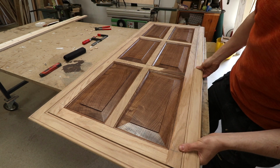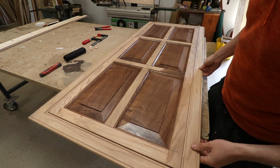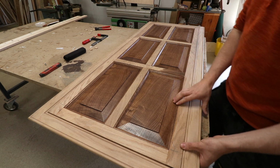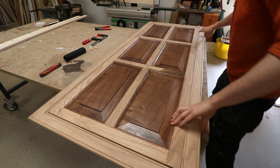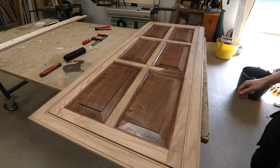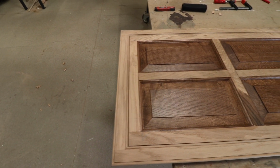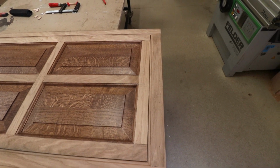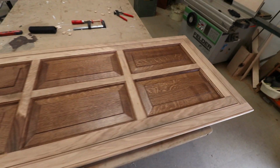The height's perfect at that setting. I couldn't have got it better if I'd tried. With a bit of luck. Quite often you'll be 0.5 mm out, so cut it again. That looks bob on. We've got about 1.5 mm at the top and the same gap at the bottom, and it's nice and parallel across the door and the frame.